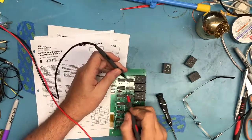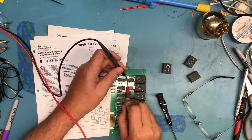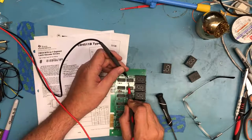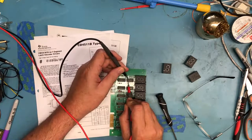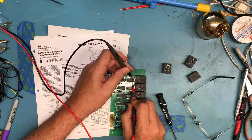and just did a bit of poking around on these. And what I discover is, from pin 1 to 14 here, there was a 55.7 ohm resistor. There's another, this one's 55.8 ohm, all the way up to, there's a resistor up here at 56.3 ohm.